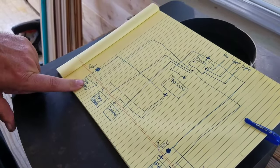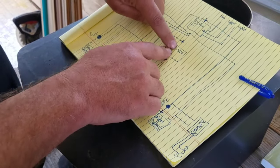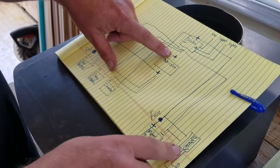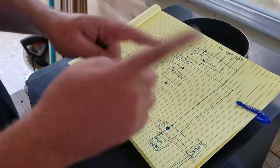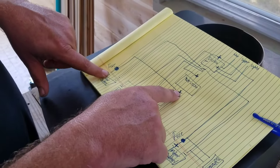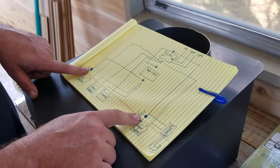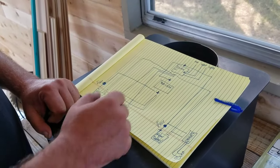What this will do is when the outboard is charging the motor battery, this battery isolator will connect and link the two battery banks together any time it sees anything over 13.3 volts, which is obviously a charge rate on a 12-volt system. So if the outboard is charging up the motor battery and it sees 13.3, it's going to open up the link and charge the solar bank. And vice versa — if you're not running and you're sitting and it's sunny out, your charge controller will be connected to the bank as well and will open up that valve and charge your motor battery. You've got to get fuses on everything. The distribution block is already fused for all your loads on that side.